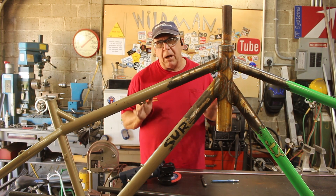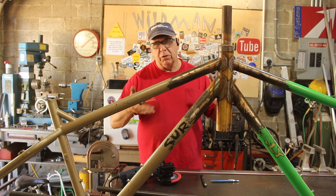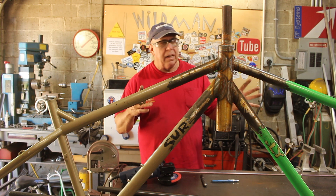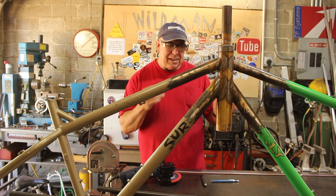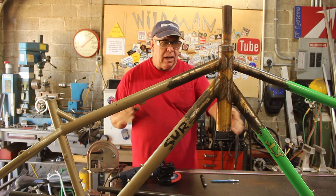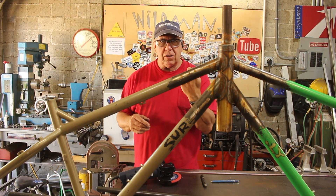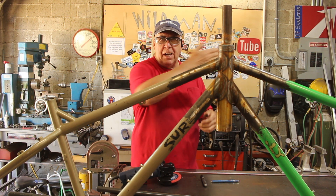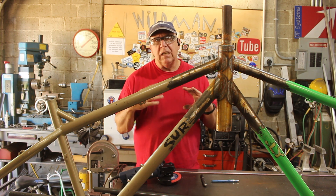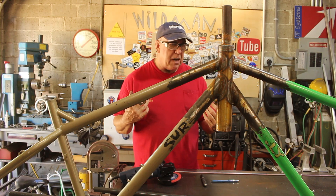One thing I discovered since the bike left the shop is that the client said it was flexing a lot all over the place — it flexed so much it actually bent. This tube is about an eighth of an inch closer to one side, so we've got kind of a banana effect going on with the frame. But that's not such a big deal — we can use the heat of the welder to warp it back in the opposite direction.